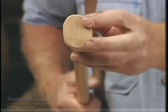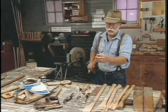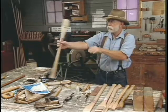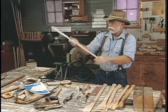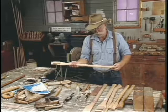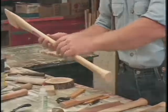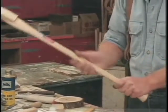If the grain is correct, the grain runs this way in a proper handle. I want to see how straight the handle is, and this one looks really good. Now this is a double bit handle and it's a slim taper octagonal. I don't know if you can see, but it's got flats cut on it and that helps you get purchase.